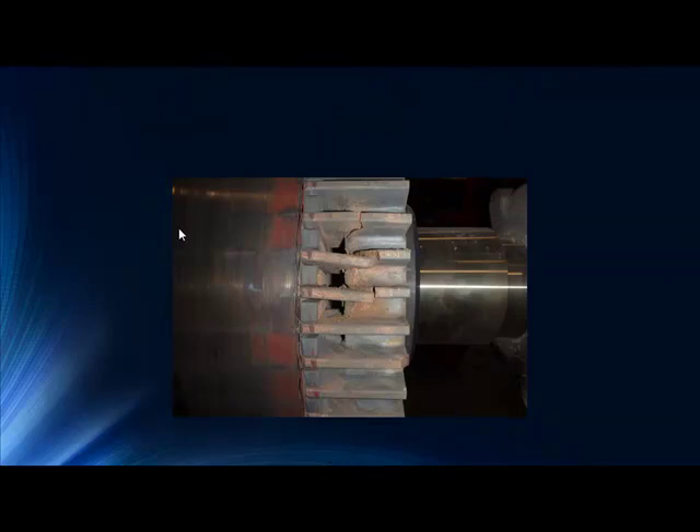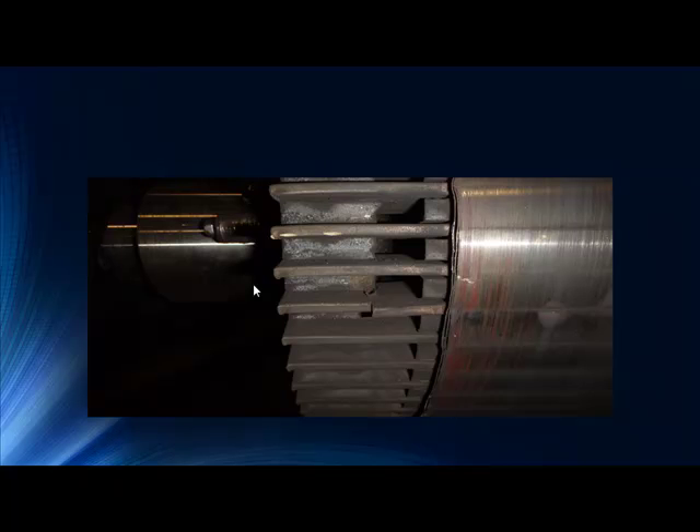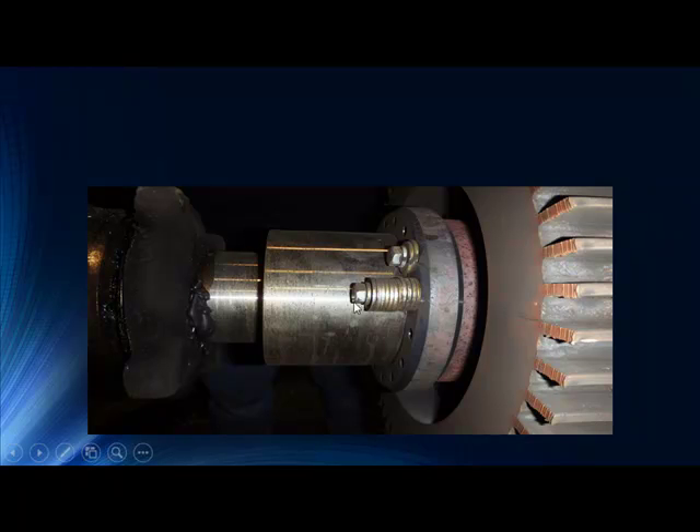The next step is to send it to the repair facility and pull the rotor. That's three very openly cracked bars — it's a closed bar design. There are also a lot of weights added behind the bars. When you see this type of weight added to try to mechanically balance the rotor, someone is trying to apply mechanical balance techniques to an electromagnetic imbalance — and it's just not going to be a success. The bars aren't going to heal, the current is going to continue to cause more problems, and the imbalance is going to change.